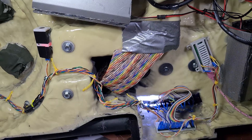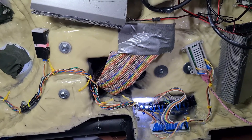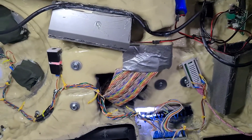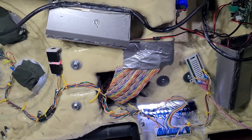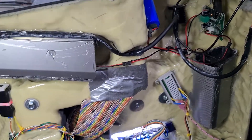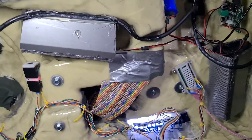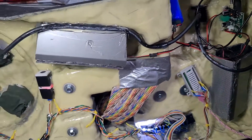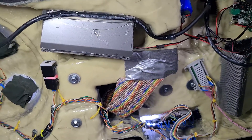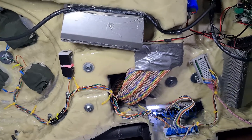That was a really neat way to get coupling between the effects without deeply interfacing the devices. The pack uses a Spengler wand, and the audio comes out through a sound bar. I didn't want to risk breaking the Spengler wand or the amplifier by hardwiring them together. The idea was: if we could detect the sound at a certain volume level inside the pack, it would trigger faster lights — and this microphone solution does exactly that.